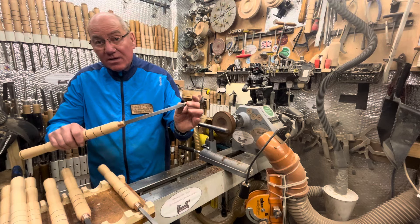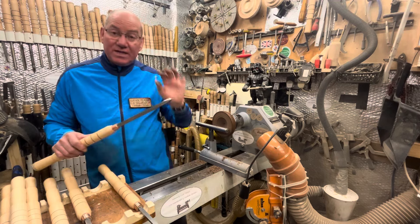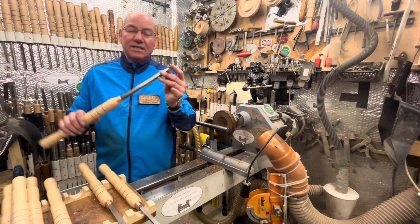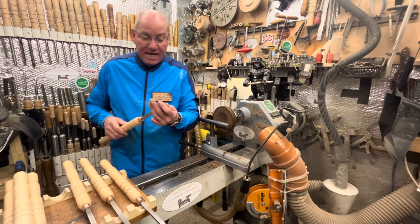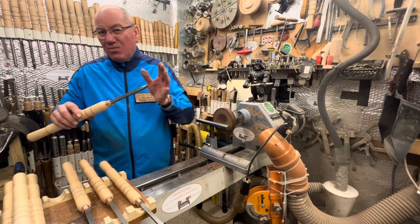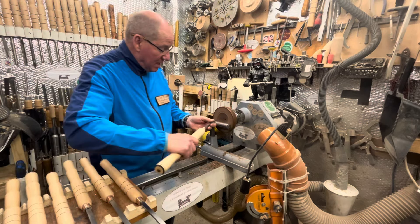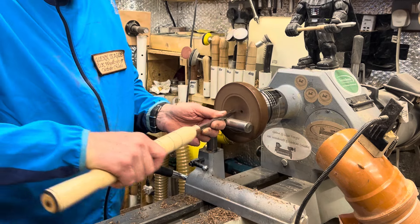Your actual cutting area is roughly the same as the tip of a three-eighths or five-eighths bowl gouge. But you've got the benefit of no flute, so you'll get less vibration with this solid bar. The 12 mil I tend to say is more like a bottom-feed for getting that clean finish, though it will hog wood out fine. The 8 mil is more like a detailed three-eighths with a pointy grind - it takes a slightly smaller bite. Sometimes you need less of a bite.